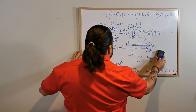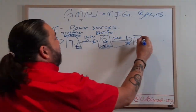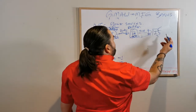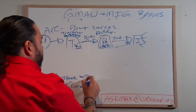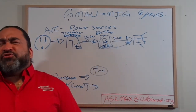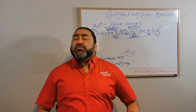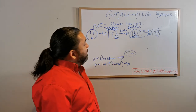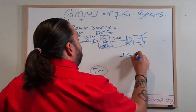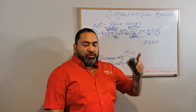Now the new tech is great. To just take this a little bit further - because the train doesn't stop there - inside of here things happen. Now that we have the ability to change things, these SCRs allowed for options. Another thing that happens in the world of electricity, aside from pressure and heat, is time. We think of electricity being at the speed of light - yeah, the speed of light is pretty fast, but that still is time. And lots of the new machines now, you'll see a thing called IGBT - Insulated Gate Bipolar Transistor.